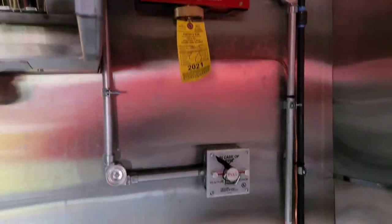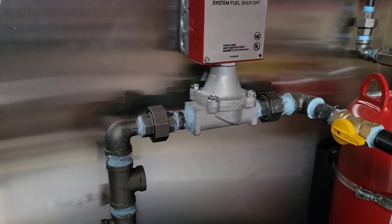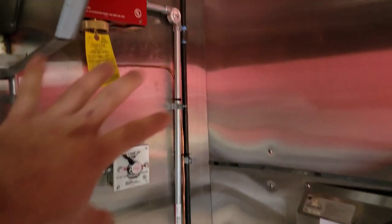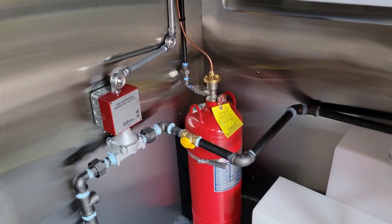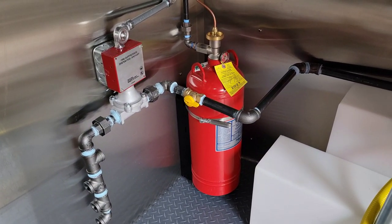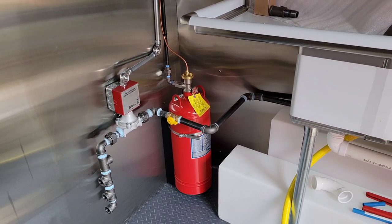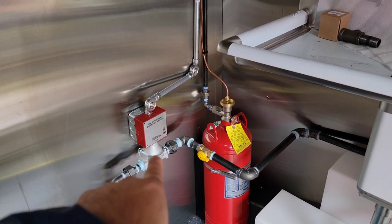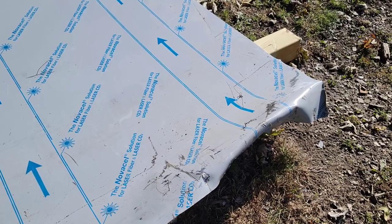It also shuts off the fuel shut-off, so it doesn't feed any more propane toward the equipment. We're going to install the flexible three-quarter-inch propane lines right from the apparatus. I like to put the tank down here — some people put them up top or sideways — but I keep mine low for a lower center of gravity because these can get pretty heavy. The price used to be $2,500; now it's about $2,800. I put all the black piping in myself — they did everything from there up, plus the tank.